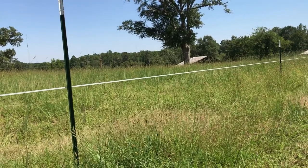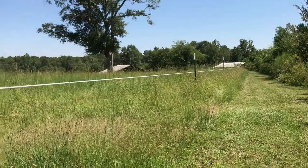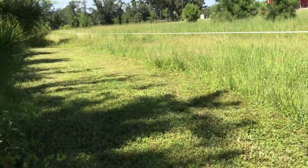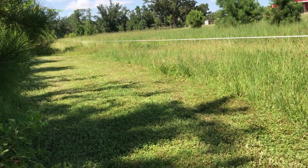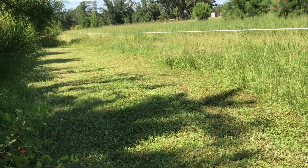We're making paddocks, but we're doing an outside perimeter with this poly tape. Now, since we're doing outside perimeter, we're getting this thing tight with T-post only. We're not using any fiberglass rods, that's more the temporary. We are going to use true T-post, and that'll hold it in.